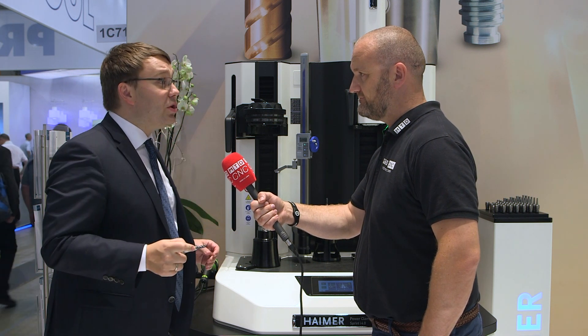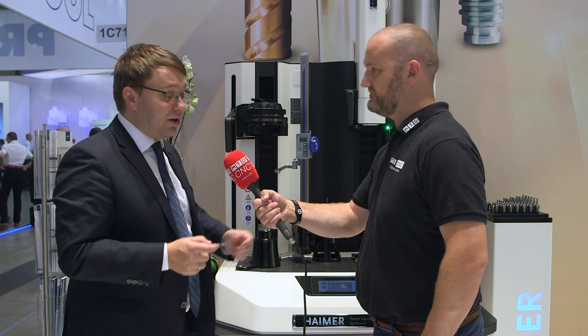When the machine comes to an unload and you're clamping a different part and you put it in your multi-spindle or multi-turret solution, you're much quicker but also much more precise. A regular ER collet only offers between 10 to 20 micron runout accuracy, while the shrinking collet always offers 3 micron runout accuracy at the top of the cutting tool — which means on average 50% longer tool life.